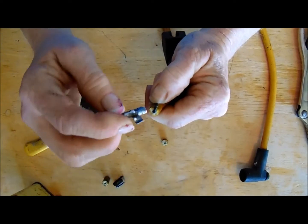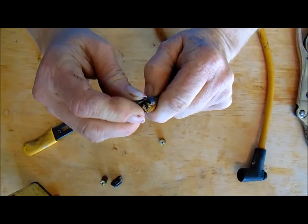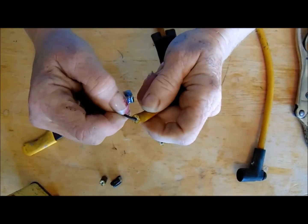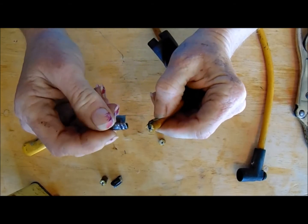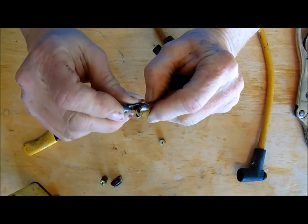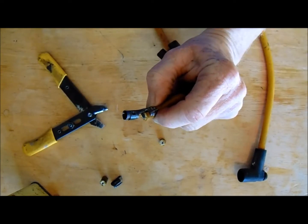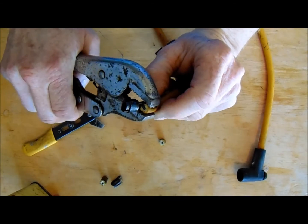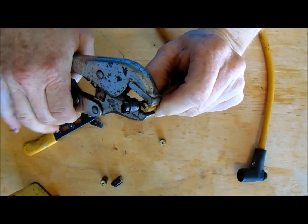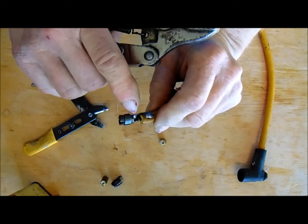You take your little clip — I open these wings up so that I could get on there easily enough. See how I press it in there, so you pull that down, pull it down like that, and put this over it — about that far. Then take something like wire cutters or vise grips to squeeze it. I'm using my vise grips because my hands aren't very strong. You squeeze it back into place — these little wings onto it. See how they squeezed on and it's holding the black wire down.